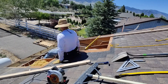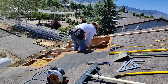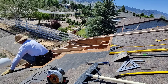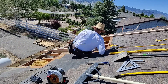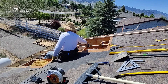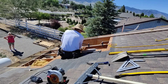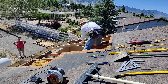So I end up using some vertical support pieces to bump those up or jack them up. Now you can see me clamping those new truss pieces onto the old, marking them, cutting them. The clamps come out. Now they're all sitting nicely parallel — the darker colored wood is the old part of the truss. I'm jacking them up so that, measured with my straight edge, the roof is a flat surface and doesn't have a dip in it.